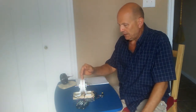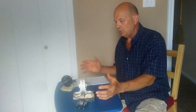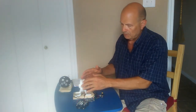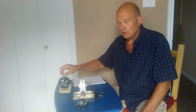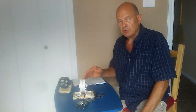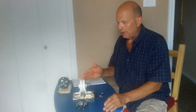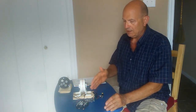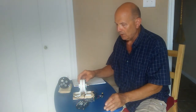first thing you could do to modify this motor, and I'm talking about this motor on a larger scale, big enough to power bicycles, motorcycles, cars. Again, to begin with, these motors are one single wire wound coil, so that kind of reduces the amount of current that can flow. So if you used multiple wires and a shorter wire and wound it to the same size coil, you'd end up pumping more amps through there. More amperage means more power. So you could easily ramp up the power. Like I was saying, this motor here is so underrated for this controller. It'd be easy to modify it that way.